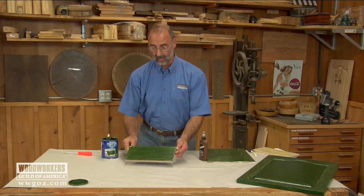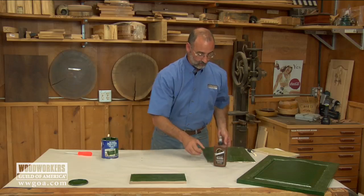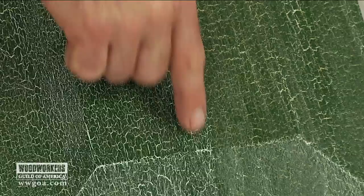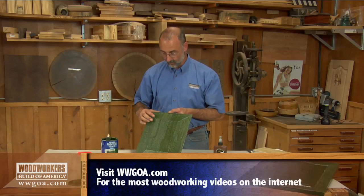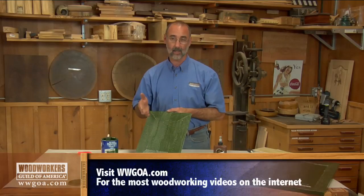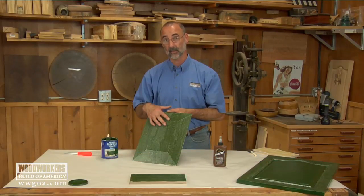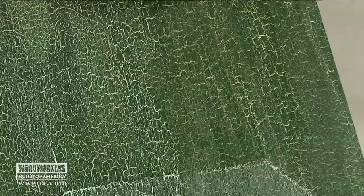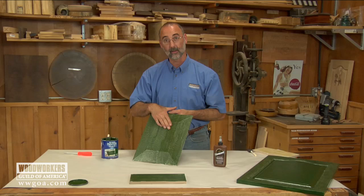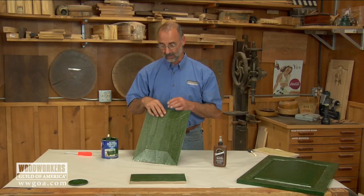Let me show you another board I worked on earlier, because you can mess with this a little bit and it's worth experimenting. You can see a line down the center where the crackle on one side is different from the other. The other variable you can mess with is diluting the hide glue. This hide glue is water soluble, so you can dilute it up to 50%. On this board, the right side is diluted 50% and the left side was put on at full strength — you can see how that affects the way the finish crackles.